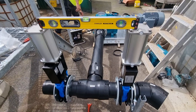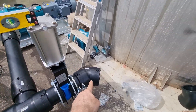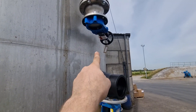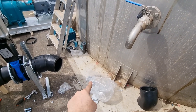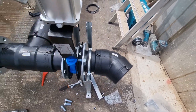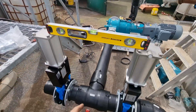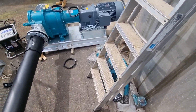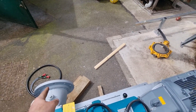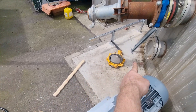These will go out of the sides of the tees on the pumps. We're just welding one of the bits up around the pump and this will be the next bit to go in - two of these onto the flanges. We'll put flanges either side so if these ever go wrong you can just unbolt them and swap them out quick. We've got our air shut-off valves set up, making brackets to go to the floor. I'm going to use two 45s, it's going to come up in the centre and connect onto that valve. They sent the wrong sizes - they sent 180s but it needed to be 225, so we can't connect that until the tank's drained anyway.